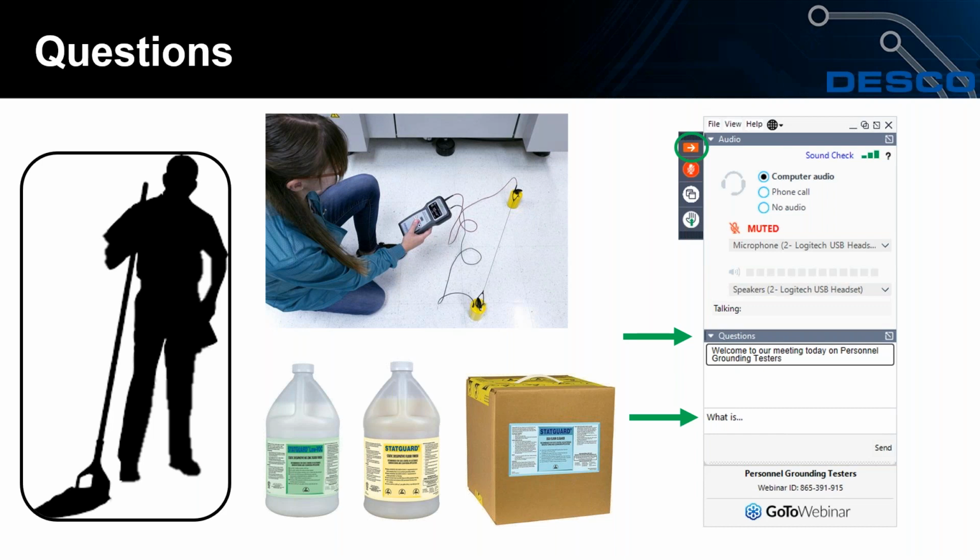Is it different with an ESD surface below? Yeah, like I said, if you have a substrate that's an ESD floor and you're wearing off your floor finish, it's really a matter of aesthetics. You're losing that shine, you're losing that appearance. The function of the floor will still be there though, because it's conductive underneath. So you're still going to get good electricals. I think that's all the questions we have for now.